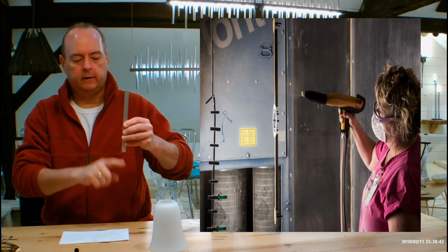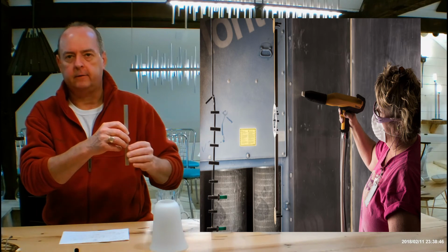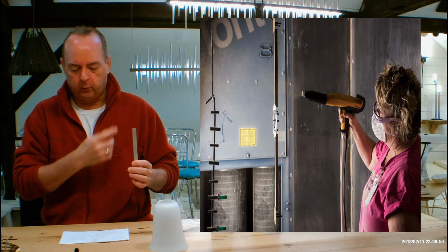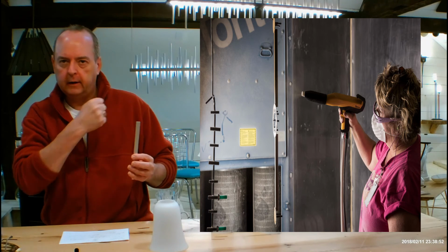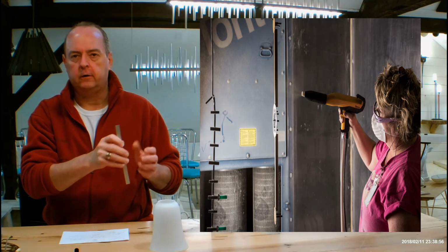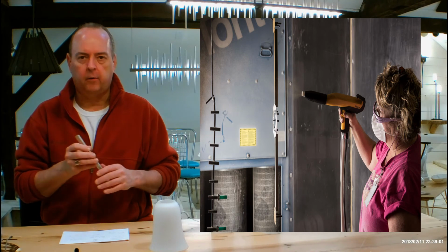They wire it up with a wire here, a wire coming down. They run a small amount of electricity through it to make it positive. And what that does, it makes it attract everything around it. So when she's over there spraying little bits of powdered finish, it's going to go over the entire fixture. It's going to get into every nook, every cranny, top, bottom, sides, the whole thing.